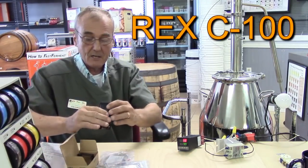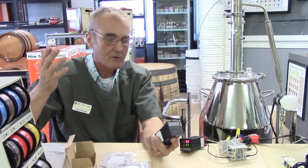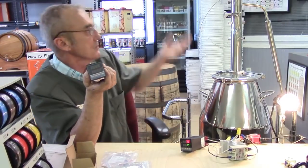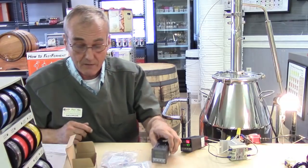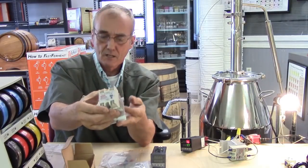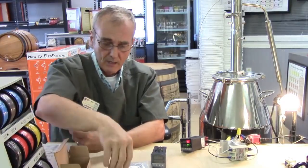Now we're going to do the same thing on this board and I'll show you. This is the RKC, called the Rex C100 — I'll have this up on screen so you can see it. This is probably the cheapest one on the market, maybe sixteen to twenty-three dollars for the kit. Just type in 'PID controller Rex C100' and it'll pop up. It's not the best one on the market but it's a very good one and it does exactly what I need. It comes with a heat sink, which is for the solid state relay — your on/off switch — and this one is a 40-amp solid state relay.